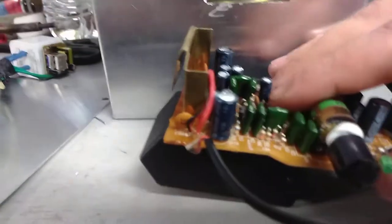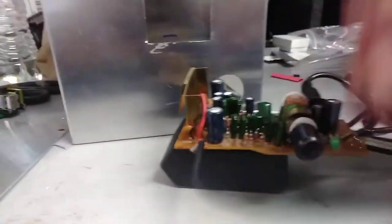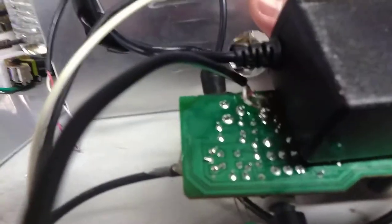It's all quick and dirty stuff. I also soldered in a couple of leads — the speaker outs — there's one here and one underneath there. I went ahead and epoxied those leads just to give the cords a little strain relief. Here's another lead that I epoxied — that's for the male 3.5-millimeter jack. So there's that assembly.